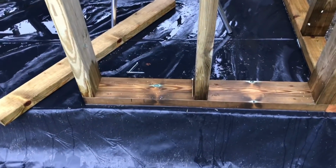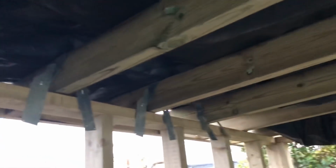This corner is really, really wet, but we'll dry it out. Just have to be careful of shrinkage and that sort of thing. So there's our steel again. You can just see it's just overhung all the way around. We can't show you the back. It's just so tight to work at the back. We've gone as close to the fence as we can, within the regs, of course. And the maximum height is 2.5 metres high from the tallest point from the ground, which is plenty of headspace, providing you're not a giant.